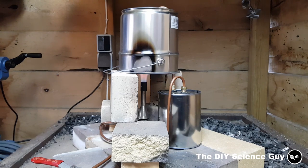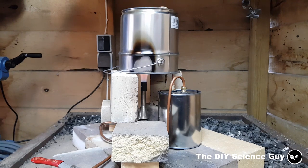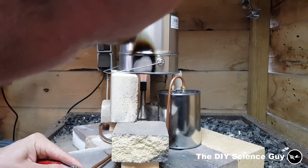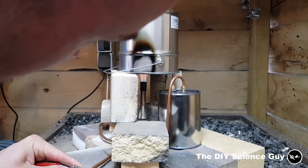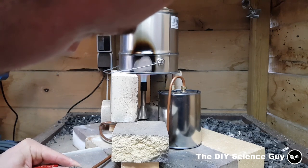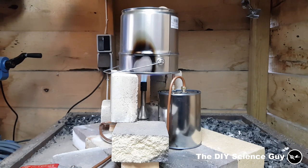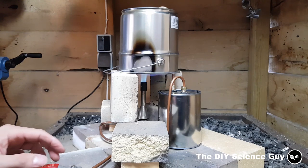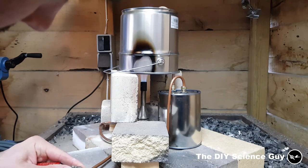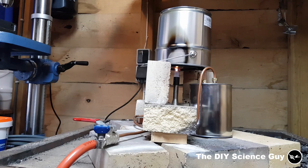It's working! It's amazing — I didn't expect that. It's just burning off its own wood gas now. Let's give it a little bit of propane to get a little bit more heat. So it's more a matter of good insulation now and containing that heat more. The gas is now completely off — the flame is still burning from the wood gas. Self-sustaining pyrolysis!